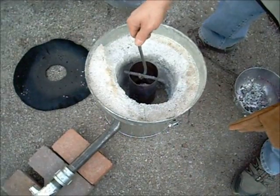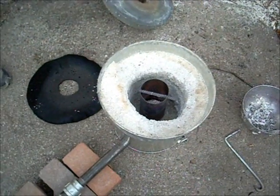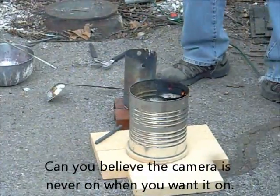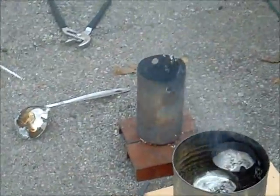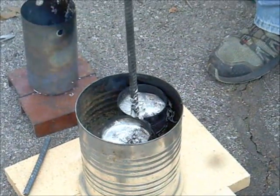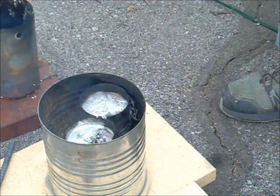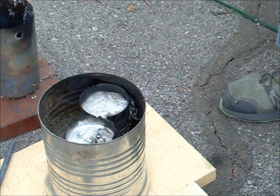We're going back in and we'll refire it back up - it was definitely hardening already. I don't think it actually went down in the hole. I think all the aluminum stayed right on top. It still melted, but I don't think it even went in the hole. We may have two big circles on top of here now. I don't think it went down the piece of foam. Maybe the sand filled it too quick, or maybe we had the wrong styrofoam.